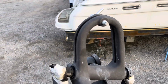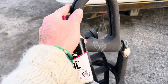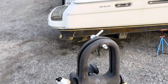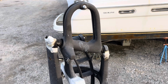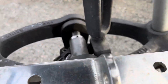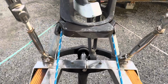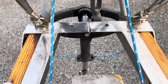All right, and this is where our blade actually fits in up here. We're going to unscrew that, slot the blade in, and try to make it as vertical as possible. Essentially, as this thing rotates, as this twists when the boat goes off course and the wind hits it, because our wind is going to be going straight past this thing, the blade isn't affected. But when the boat turns too far downwind or too far upwind, that's what's going to kick this over. What we see happening here is that our blade turns, and when we're moving forward, that blade turns, so then it's going to go off to the side and you're good to go. That's what corrects the course.